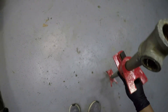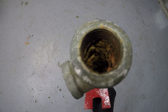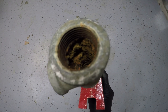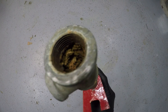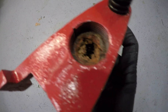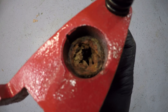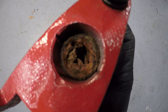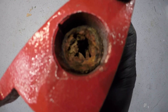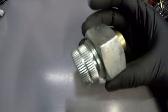There it is. If you drink water from your faucet, just know that your water goes through all that. This one's even worse, and this is why you get restriction in your galvanized pipes. This three-quarter inch pipe turned into maybe less than a half inch — so use dielectric unions and switch to copper.